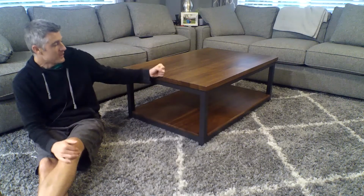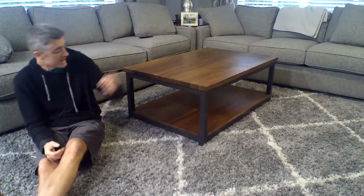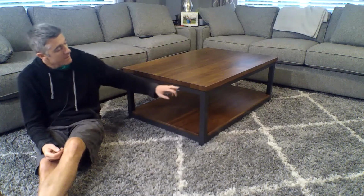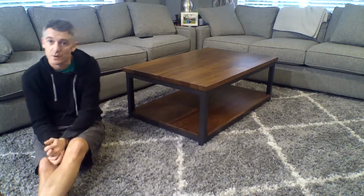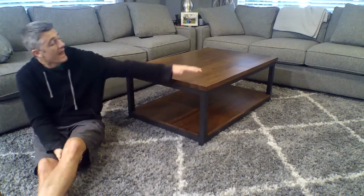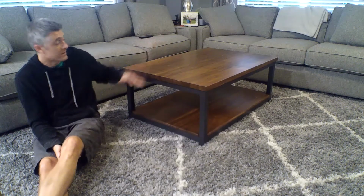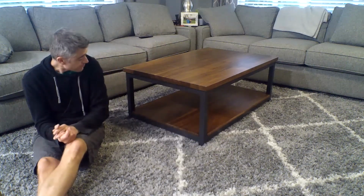In this video I build this coffee table for our living room. It is made from walnut and maple. The base is made from maple and is joined with mortise and tenon joints in all the corners. It then has a cross member that is dovetailed into the long aprons to keep them nice and straight.